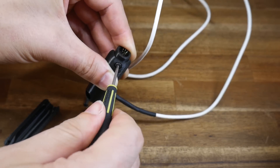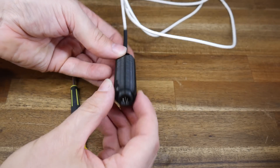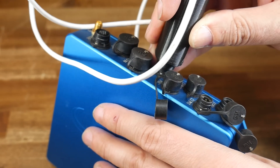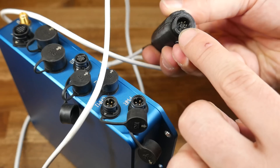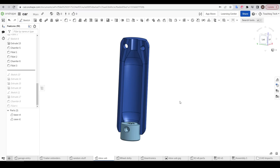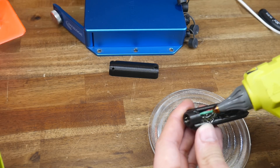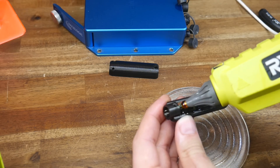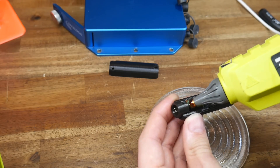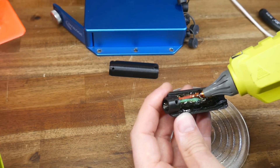Those beveled mating surfaces are really handy for getting perfect alignment. We start by bolting one side to the initial pin housing, followed by the second half, then finish with the two bolts up top. It's a little chunky but everything is contained. I matched up the arrow and carefully aligned the pins before inserting the plug, and it went on smoothly — but a problem I had anticipated was occurring: the pins could still slide inside the printed housing, preventing them from inserting into the port. That's the real reason I made the cavity so cavernous — there's purposely room inside for the final component: a generous amount of hot glue. This serves two purposes: it will make the cable somewhat waterproof, and more importantly, with glue between all of the wires they should be supported and locked together so they can't slide in and out of the housing.